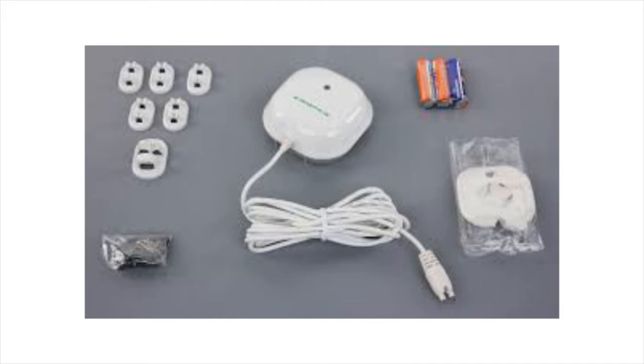It's very simple. It adds to the HomeSeer Z-Wave setup just like any other Z-Wave sensor — put it in pair mode, put the batteries in, and it should recognize. This device is also compatible with other Z-Wave systems like SmartThings. It's really advertised with the SmartThings hub, so it's not exclusive to HomeSeer but works with any Z-Wave network.